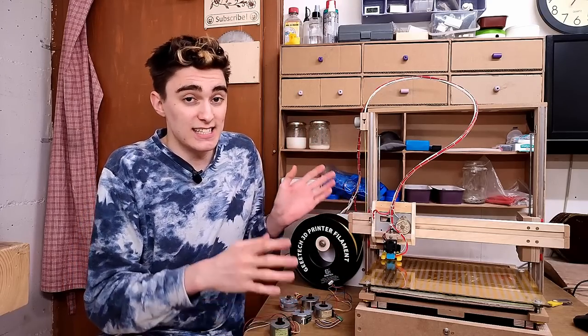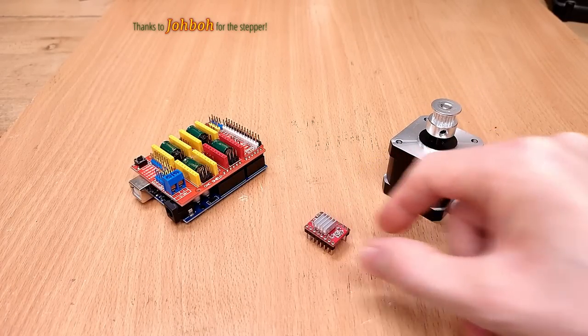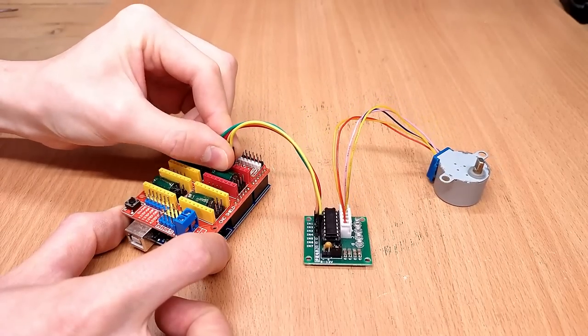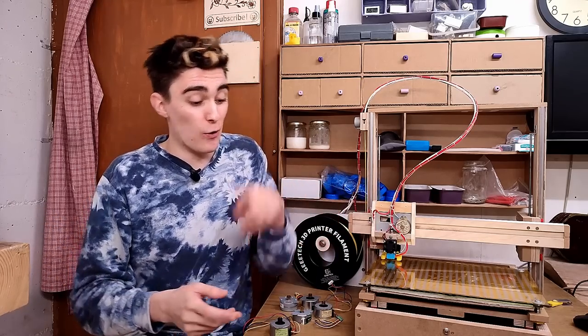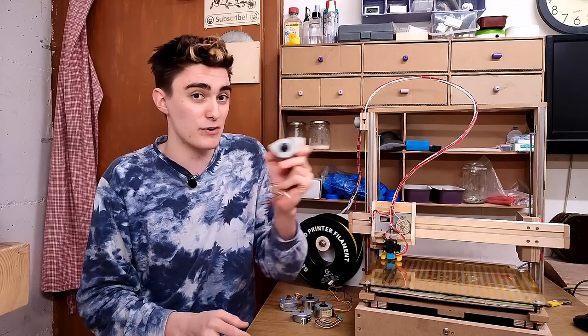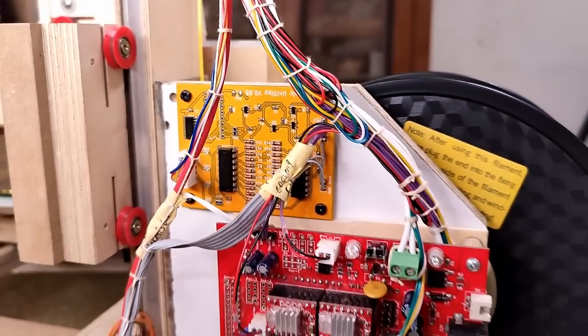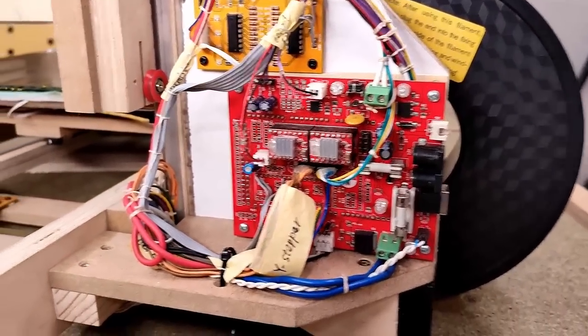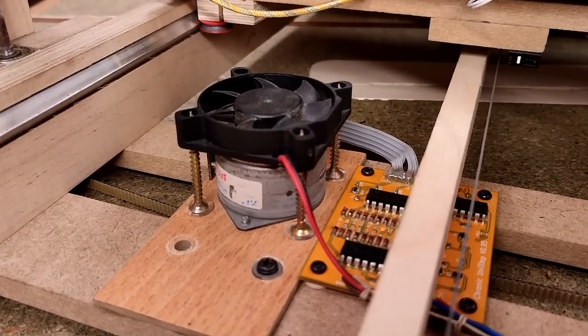Furthermore, if I want to use unipolar stepper motors on a 3D printer or other CNC, the firmware on these machines is designed to run bipolar motors with dedicated translating drivers. So simply hooking up the ULN2003 isn't going to work, and modifying the firmware to also take care of driving the motor — well, good luck with that. So I designed my own unipolar driver to be compatible with the existing software ecosystem.